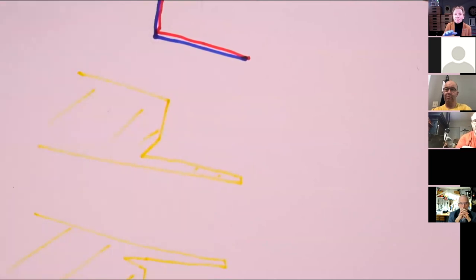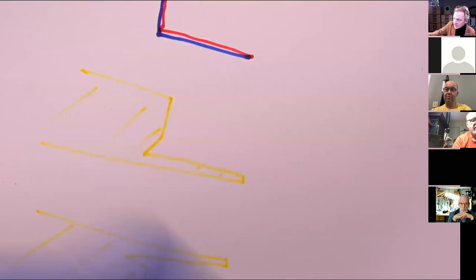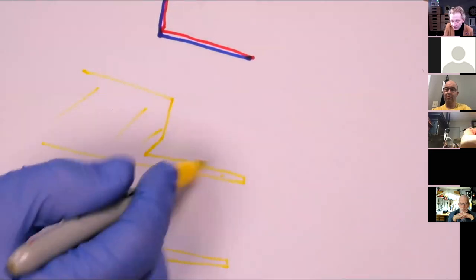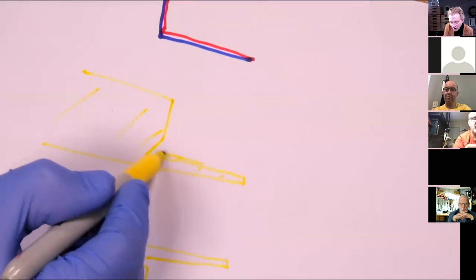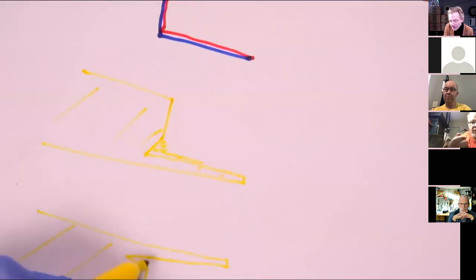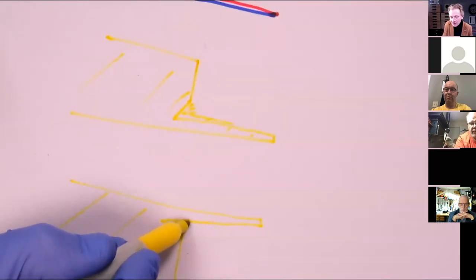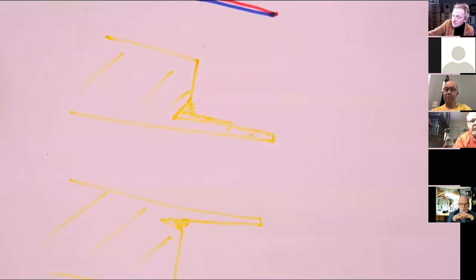If you look at your lathe bed, like a center lathe where the cross slide fits on, the edge will always be beveled or cut away underneath, because over time either dirt or bits of metal get built up. So they get pushed down here and built up until eventually this little cutaway bit, which I've drawn quite exaggerated, gets full of dirt.